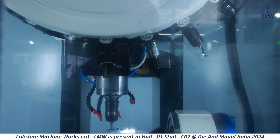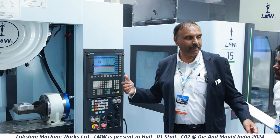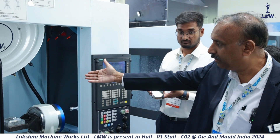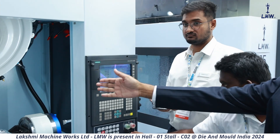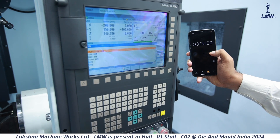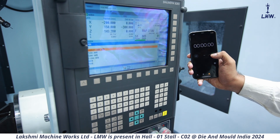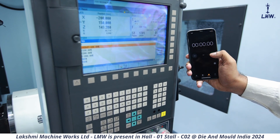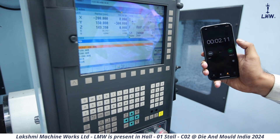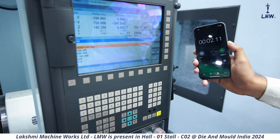I could just show it to you so that you can really see what it is. When I show you the timer, you can just look at the spindle — we'll start and give a program, and you can actually see how fast it is. So it's about 2.2 seconds is what we have achieved now for reaching the maximum speed of 24,000 RPM.